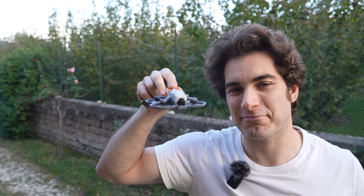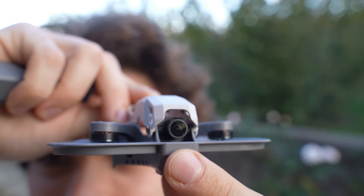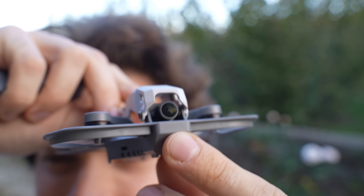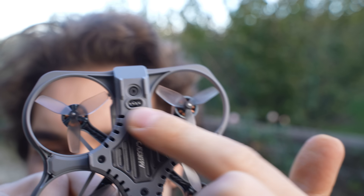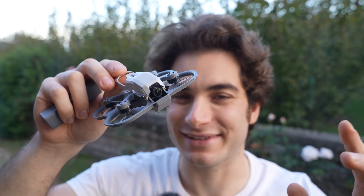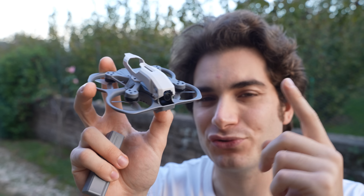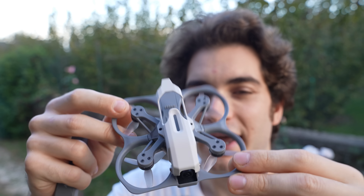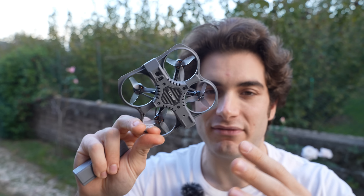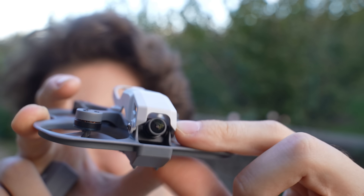This little drone can maintain altitude and position without GPS. At the front you have the Ascent Lite camera with its board — the entire system is only 6 grams. It transmits 1080p at 60 frames per second at 20 megabits per second with only 100 milliwatts of transmission power, so don't expect it to go super far. You have to manually adjust the camera angle as there is no gimbal.